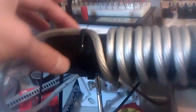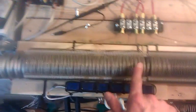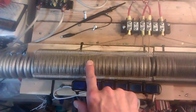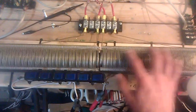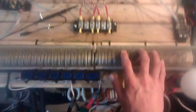You can see I had to use a smaller diameter form. I've got the primary, which — if you were to compare it to the secondary — it's using a half wave for one of them, but I've got them paralleled, and it does seem brighter than using half the length. Compared to the secondaries, it's one quarter of the length of the total copper here, and equal weight as well, keeping to the length specifications.